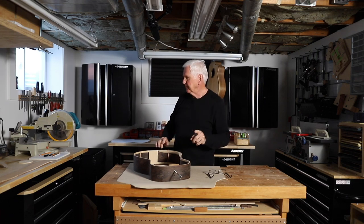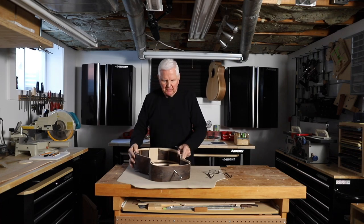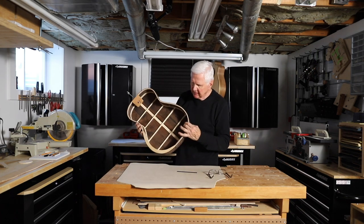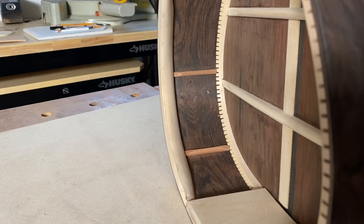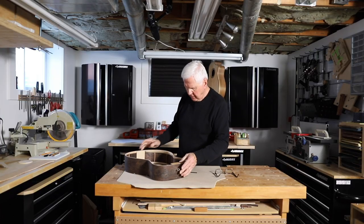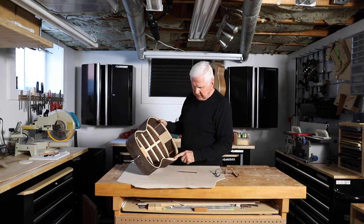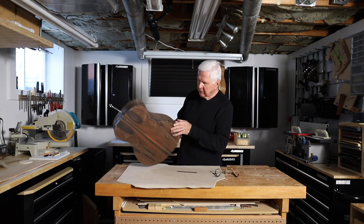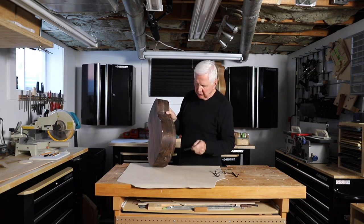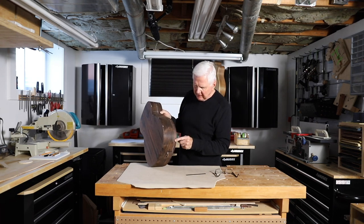Here's what I have done. I've actually taken a ruler and measured every so often to get the thickness in here. What I did next was transfer these little marks from here to the front side — the outside — of the guitar. I drew a line down along here and then simply took a pencil and roughed it in.